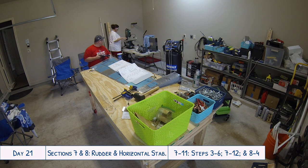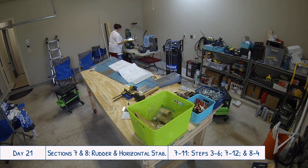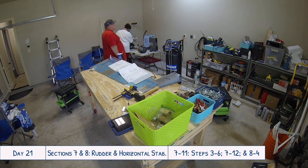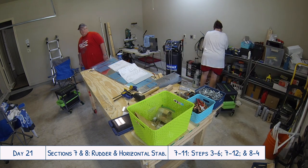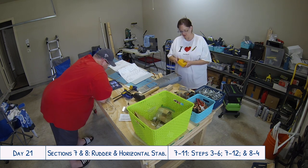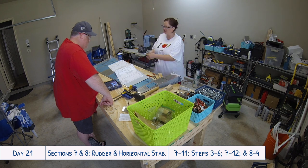The other thing the directions mention is you have to drill two holes into the wood that's going on the bottom, to provide space for the dimples already in the skin from the holes you've match-drilled into the flanges of those top ribs. Just get a screw big enough to hold the dimple without squishing it — if you had two flat pieces and clamped it down you'd flatten the dimples. So mark where the holes are with a pen, drill with a bit large enough for the dimple to sit in comfortably, and you're done. Easy peasy.